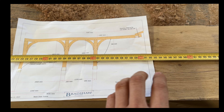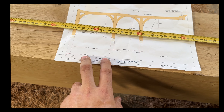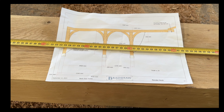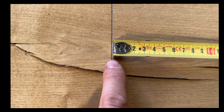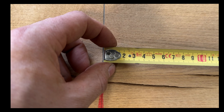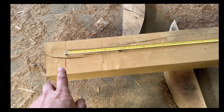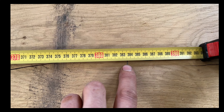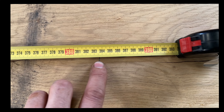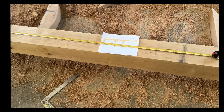That way you can cross-reference and lose that repetitive error from, say, marking your 200mm and then marking your 1376 on and another 200mm off that — you can be a few mil out by the end, which is not so bad on green oak work. But it's also a good reference to check to see if you've got that 100mm-out error, which is the way you would accidentally start your tape measure on 100mm rather than the end, because it's not very accurate against the line. I'm just cross-checking these with my drawing to make sure — we've got 3836 as my marking point, so we're pretty much spot on there.